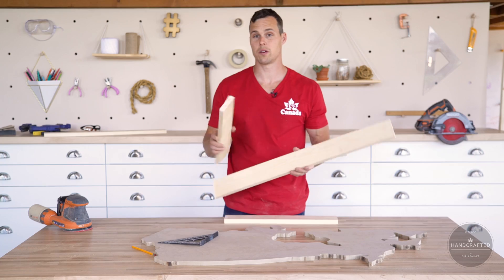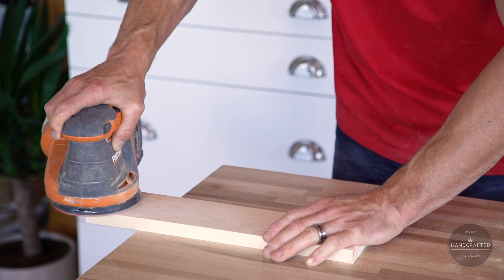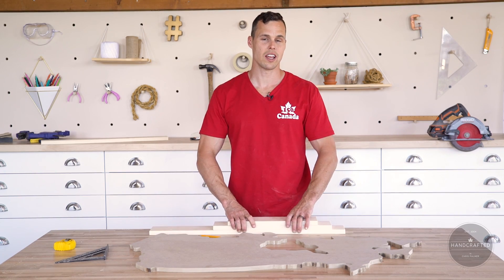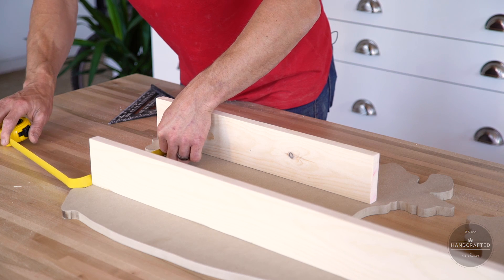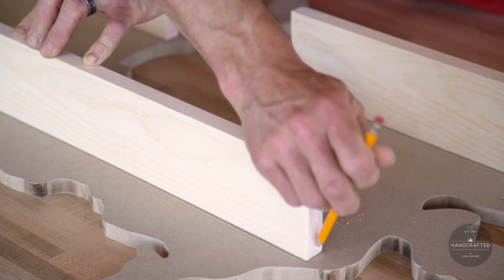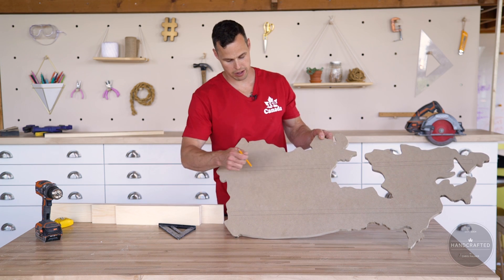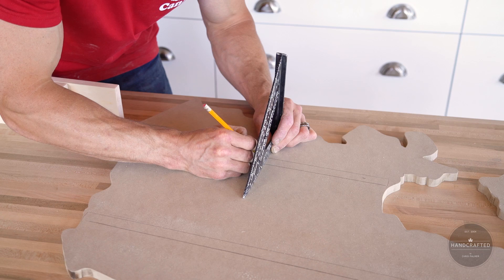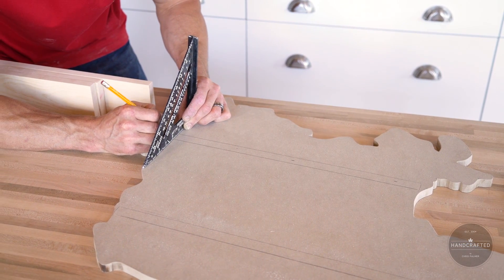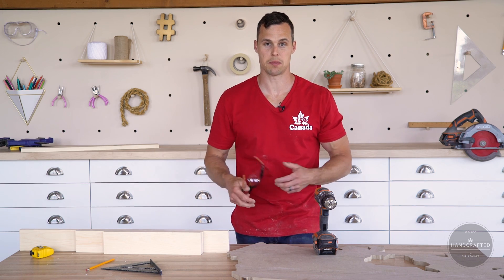My shelves are all cut out, a little rough on the edges, so I'm just going to take my sander and finish them off. Next I'm going to take the shelves I've just finished, lay them out on the country, and trace them out so that I can mark their spots. With all my markings on the board, I've got perfect rectangles. What I need to do now is indicate where the center is and do certain locations for the drill. My next step is drilling out these holes I've marked and then we'll dry fit the shelves with clamps.